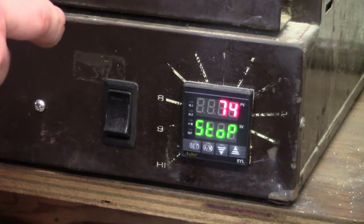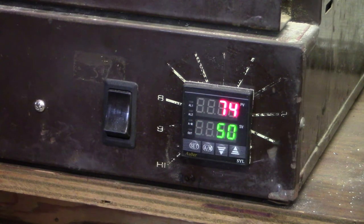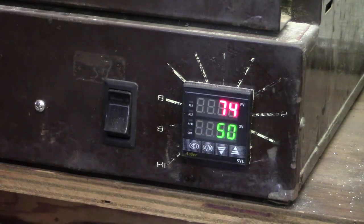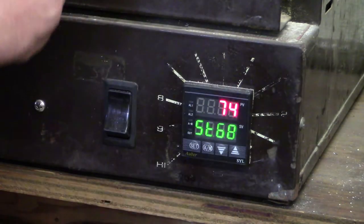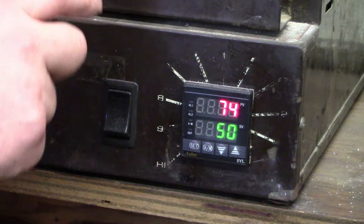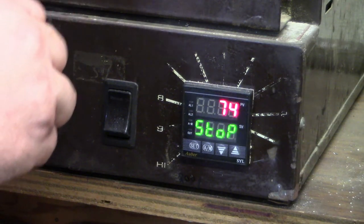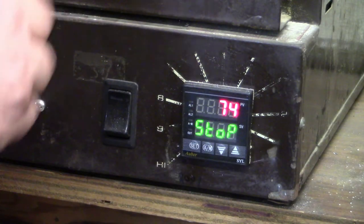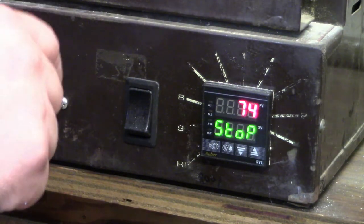So I'm going to set the temperatures on the furnace. I actually converted this to digital — you can see some remnants of when it was manual. I converted it to a digital controller so I control all those ramp times and don't have to stand in front of the furnace for the next eight to ten hours. If any of you are interested in what it takes to convert one of these over to a digital furnace, please send me a message. I have a whole parts list and a wiring schematic that tells you exactly how to convert one of these manual furnaces to digital.